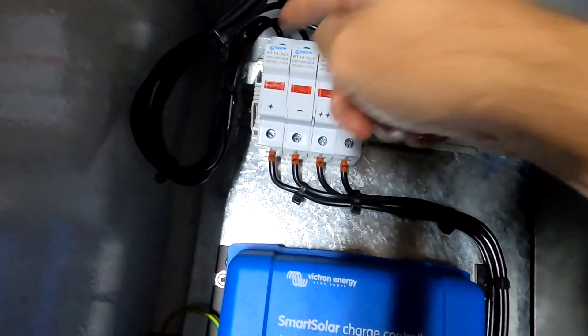I'm combining the positives and the negatives into one circuit breaker. If you saw the last video, we did the test with the clouds — people were under the impression you need a diode between your strings so power doesn't flow from unshaded cells into shaded cells. I disproved that: even the shaded cells are still producing power to the system, so we can just combine these cables into one circuit breaker.